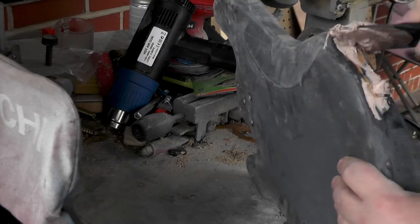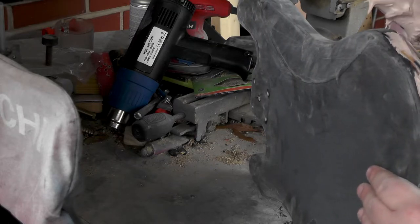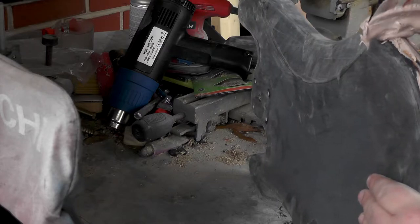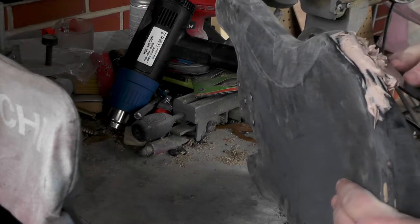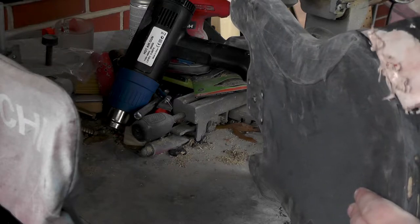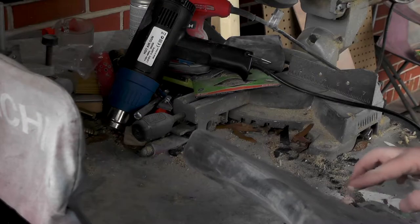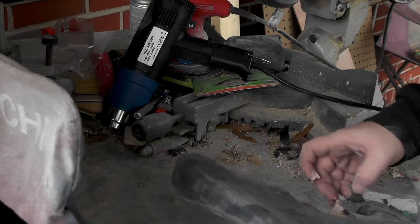Now I'm going a little bit overboard on the edge, and then I'm smoothing it off. I want to press it down onto the exposed wood, because that hole is really bad, and that way it'll have something to grip to. But this stuff does get hard, so you don't want to leave a bunch of extra on there, because then you'll have to sand all that off as well, and that can be a huge pain in the butt. I'm sorry for the angle over there. Also had a little spot on the neck joint that had a chip out of it, so I filled that as well.